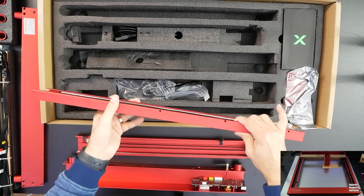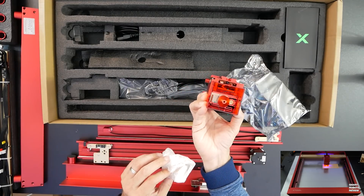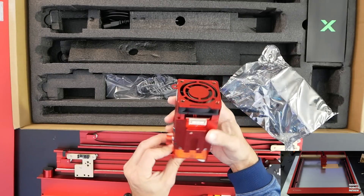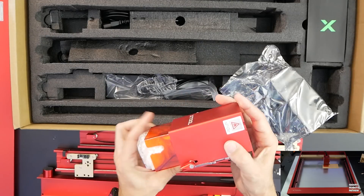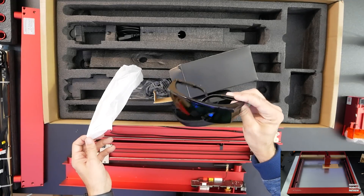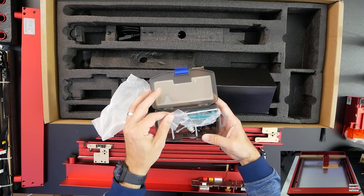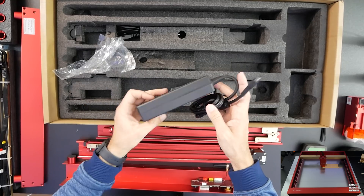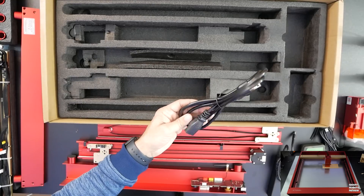Here are the belts. And this is the 20-watt diode laser. If you're wondering what that is, think of an LED, which is a light-emitting diode — this is a laser-emitting diode, or an LD. LEDs are used in TVs, Blu-ray players, and all kinds of electronics, and they convert electrical current to light. This LD converts it to a laser. Protective goggles, of course you need those. And then some other accessories: the screws, power supply, USB cable, and the power cable.